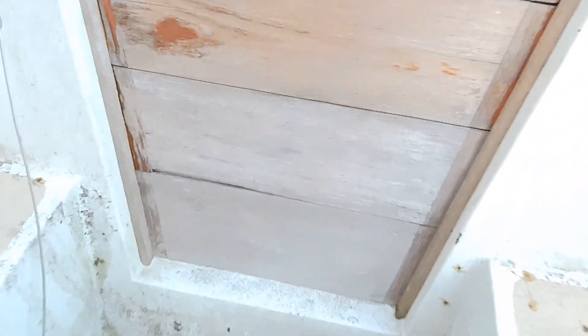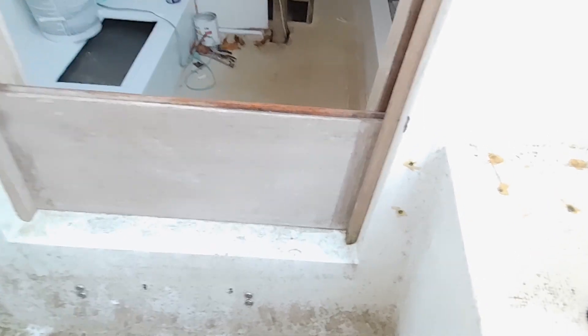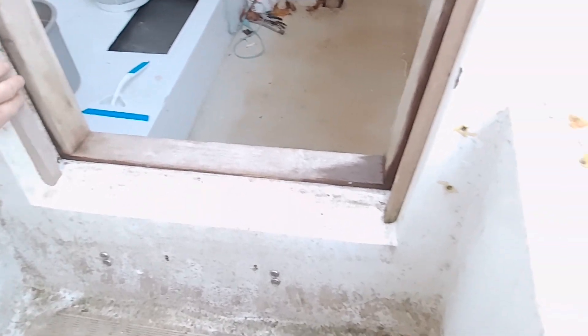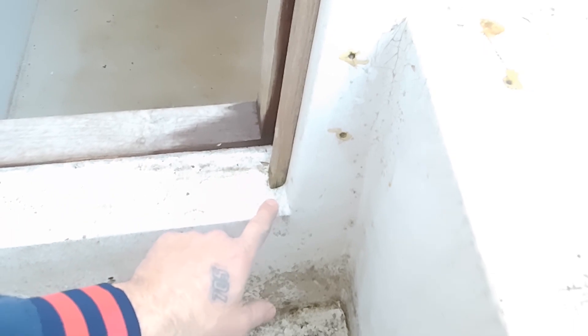So I have to figure out what we can do about that. My dad has a couple of ideas. As I was looking over this the other day, we noticed water coming in because these drop boards seemed to have quite a bit of space in them. I was going to try to rebuild the drop boards, but this type of wood is really expensive these days. So I decided instead of doing that, it looks like on the bottom of these drop boards, when the water seeps in, it's draining into the cabin — that's the bigger issue — while it should be draining out into the cockpit.